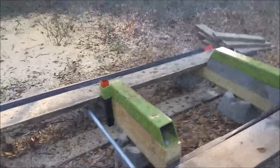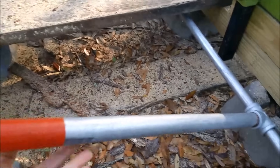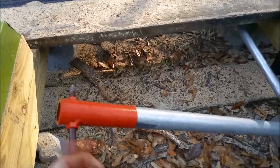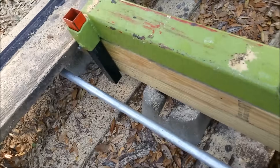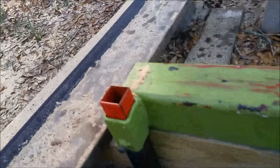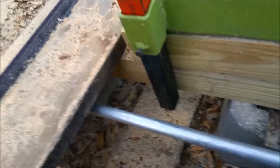As for the log dogs — these slide up and over, you wedge it into your wood, then turn the handle and it secures tightly. It's just a one-inch T over a three-quarter galvanized steel tubing. I borrowed that idea from someone — I don't remember who to give credit — but it works very well, cheap and easy.